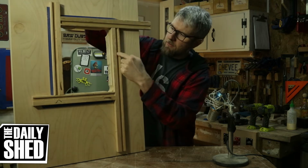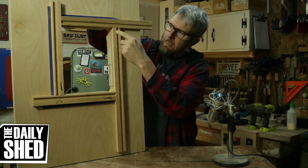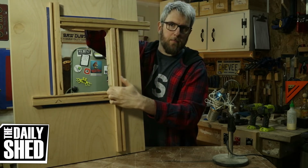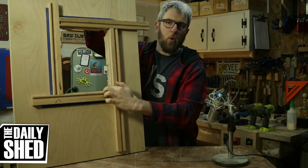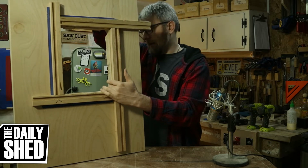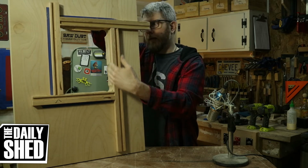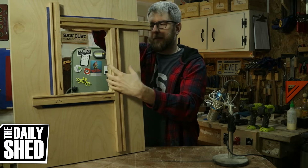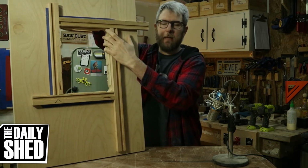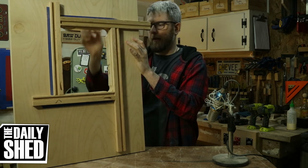The instructions tell you to line the plate with strips of wood, and then you can use this as a routing template. So first off, drill out the center of these holes with a 1.5 inch Forstner bit, which I just happen to have one, and then flush trim all of this with a router so that this opening will be the same size as the router plate. And then the feet will mount down here, and then the little set screws, and then they'll stand up.